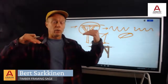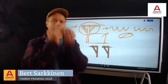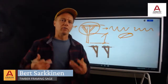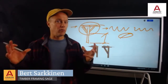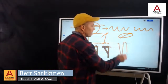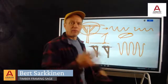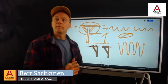The frequency of the earthquake was higher than that of the old building, but matched the new building, and therefore it crumbles. And so the thinking behind all the hold downs and the shear nailing and all the X bracing, everything with earthquake proofing, is to build such a building so the frequency of the earthquake has to get pretty high before that frequency matches up. Therefore, the building will stand up.